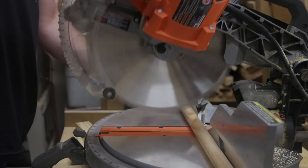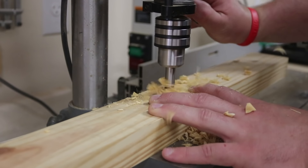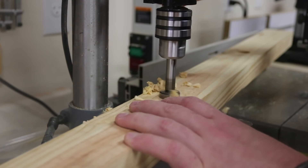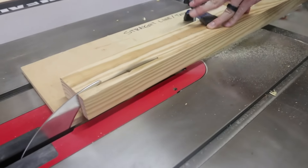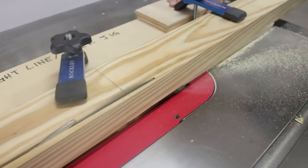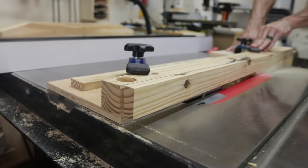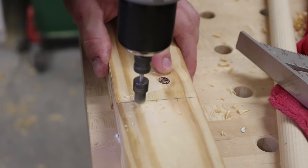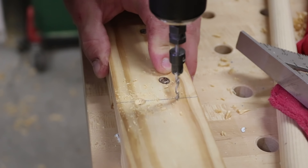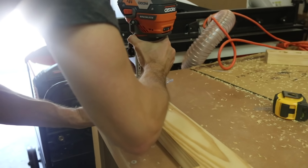While the balls dry, we move back to the build and I cut the dowels to width as well as all of the holes for their mounting on all of the vertical risers. These are all mounted center and 13 inches apart from each other. If you're interested in making this build, we do have a free plan available in the description for this and for the cornhole boards. Brad's tapering the verticals on his tapering jig and then countersinking all of the mounting holes for the verticals to the bases.